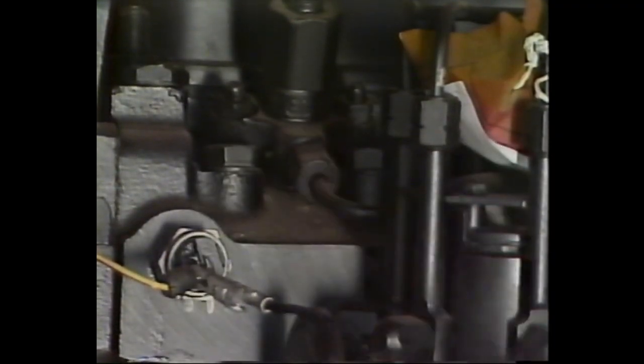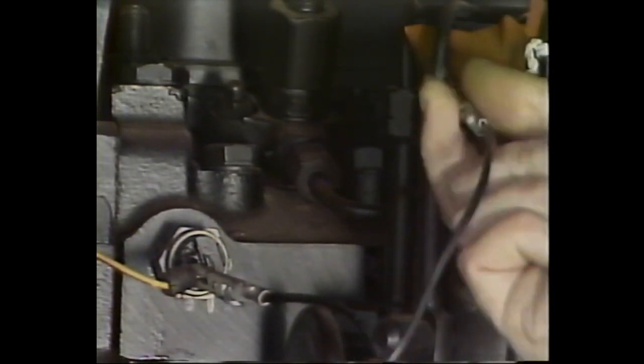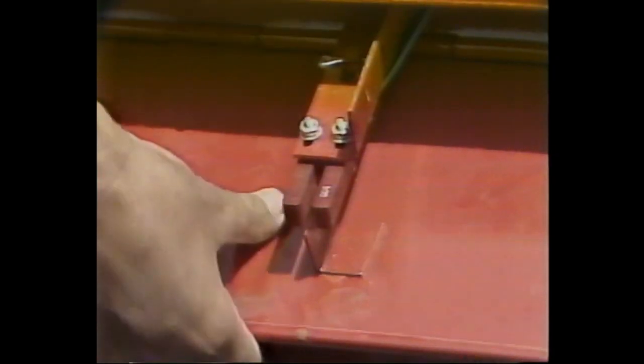Third, pull the parking brake into the position. Both the light and tone on the monitor should activate. Fourth, open the stone trap door and check whether the light and tone activate. When you've completed your checks of these systems, attach a ground wire to the hydraulic oil temperature and engine coolant temperature switches on the combine. Once connected, the appropriate lights should come on and the warning tone should sound.